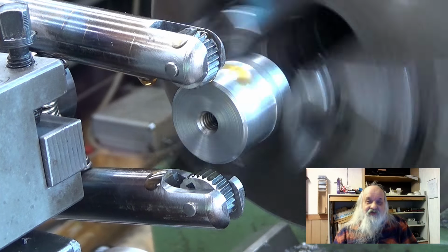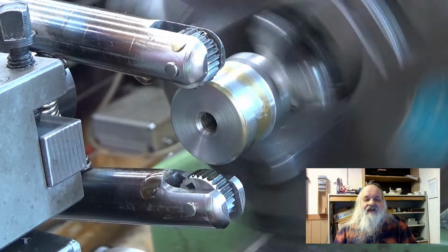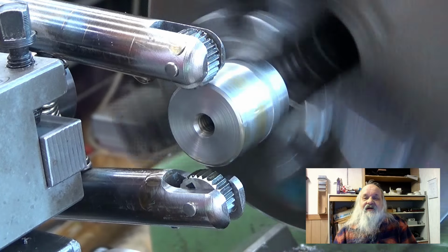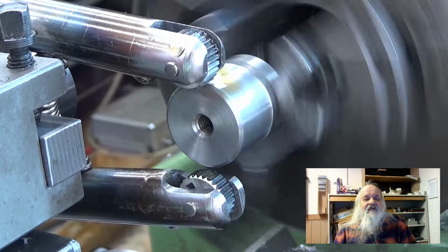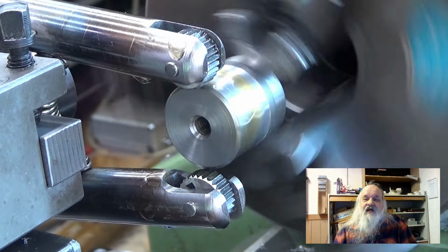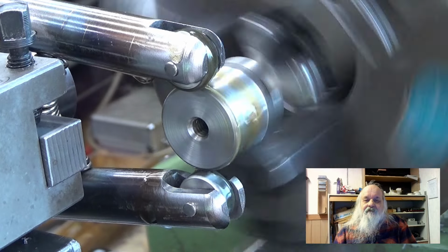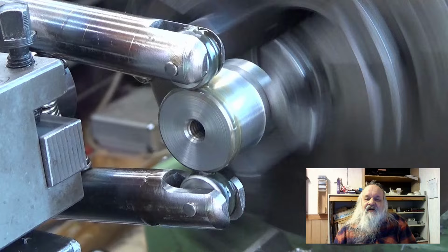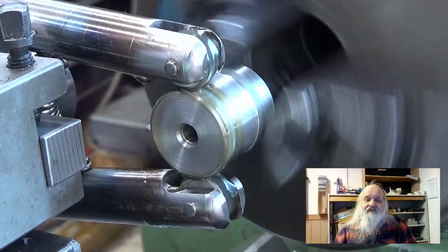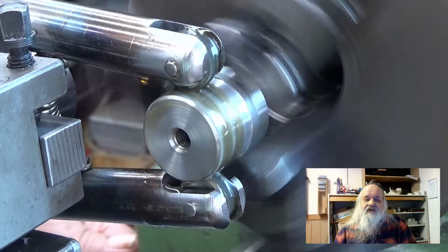Here I am about to begin my first knurling job. It will be a straight knurl, which is supposed to be hard to get right. I have adjusted the tool using the cross slide so that the wheels are quite exactly at the opposite sides of the workpiece. The knurling wheels are also straight, as I always keep the top slide straight. I start carefully to see how this works.